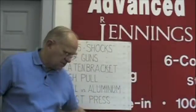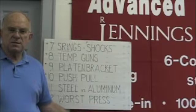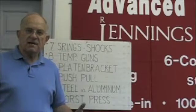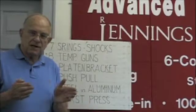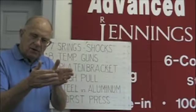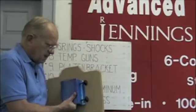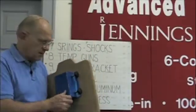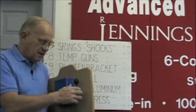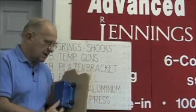One of the very expensive presses on the market has that sort of single-knob arrangement. We've had customers come to us infuriated because an employee printed 300 shirts with the platen crooked — when he turned the knob, the platen cocked and all the shirts were printed off. Here's a different type of arrangement: you have the bracket with two knobs. There's nothing projecting — the platen arm is right here so you've got a low profile. By tightening these two against the arm, you're not going to get that rotation. That's a better idea.